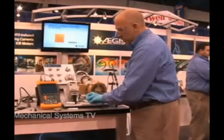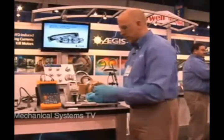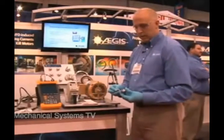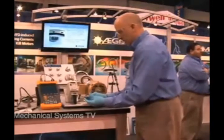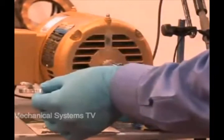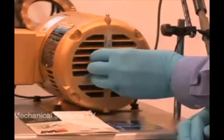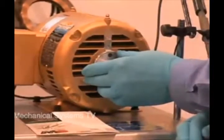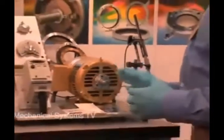You want a consistency that you can work with to apply it to the back of the bearing protection ring — the Aegis bearing protection ring in the U-Kit. This process is very straightforward: just take your conductive epoxy and put it right around the edges of each bracket, so you have a nice surface of conductive epoxy on each one. Then take the bearing protection ring, slide it over the shaft of the motor, and press it against the motor right where you removed the paint, so that you have a nice conductive link with the conductive epoxy. That's how you ground the motor through the ring.